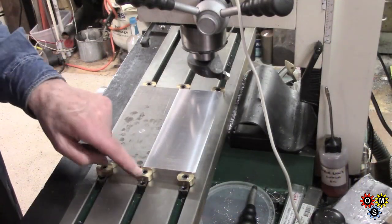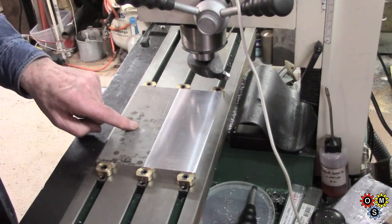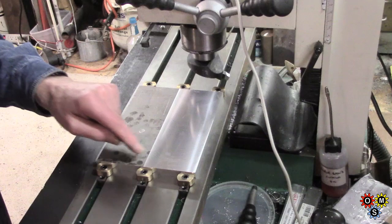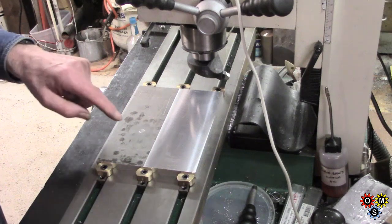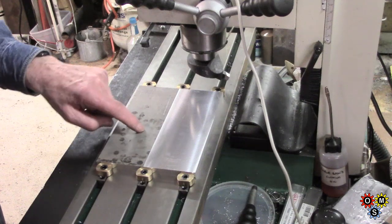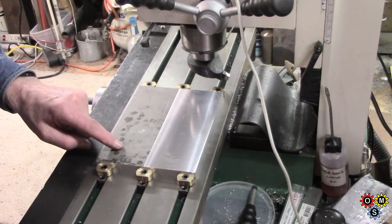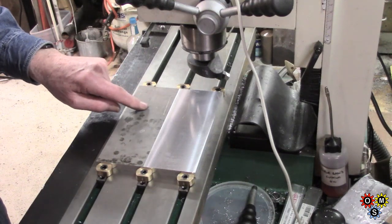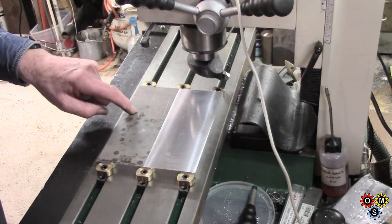Right, we're set up on the low profile clamps. I've taken one pass with the fly cutter - it's fairly slow so there's not really a lot of point in trying to video all of that. This is the bottom side and I've put a lot of lights off because this is so reflective. This side of the plate is very beaten up - it's even got a dent here from an air gun pellet I think. I'm only taking a skim of about 3 thou and I'll probably only take about the same on the other side.